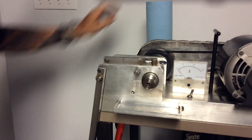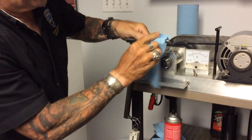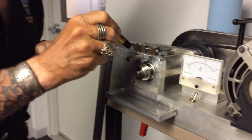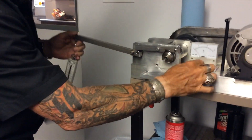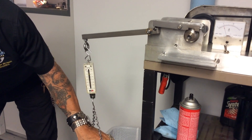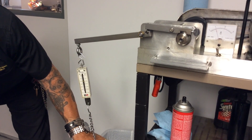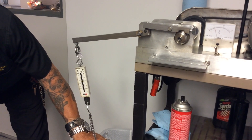All I'm going to do is take a clean paper towel and wipe the excess G96 off. Then I'll take the weapon shield and put a drop of Weapon Shield over all this galling you see on there, because I want to make a point. Same deal — we'll come right down to failure point. The Weapon Shield is relapping and reworking that surface to a smoother finish; under the boundary conditions, it's rolling out the asperities.